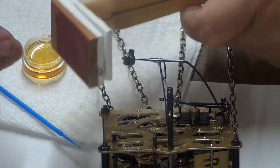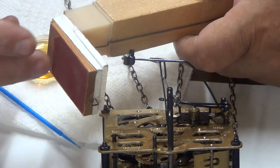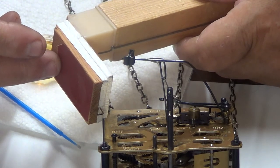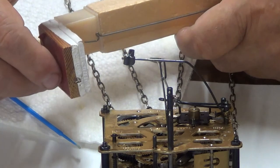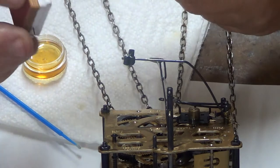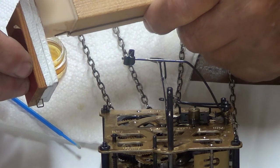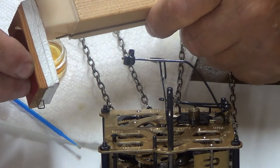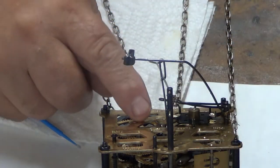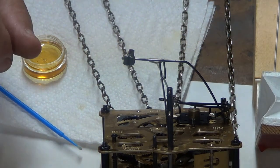Then you're going to be buying one of these bellows, and they're not that easy to put on. They're not that hard either, but they're about $15. And by the time you get them shipped in, you've got $20 in them. So that's why it costs so much to clean a cuckoo clock, because most of the time these bellows are shot. If you look, this is a new bellow put on here. So this clock had been cleaned maybe 5 or 10 years ago, but it wasn't cleaned properly, and no, I didn't do it. But it wore out the pivots in these shafts here, so I had to rebuild them. So, all right, enough said with that.